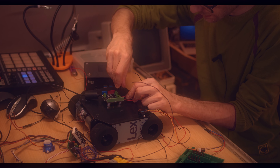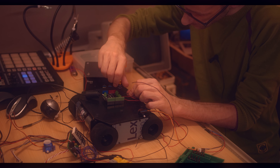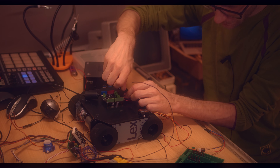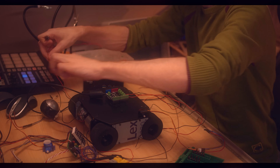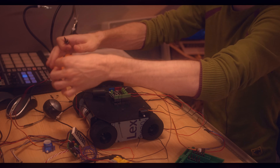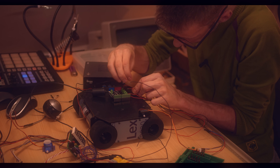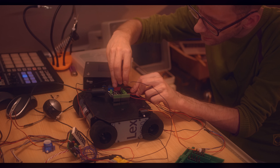Let's just turn this over real quick. This will be chaotic because I don't know how to structure things. Here we just have four B3 motors, 12 volts each. Each one of them has a positive and a negative wire. Very simply, you just solder them on — keep it somewhat sane, but in the end you do whatever you want. Basically the way this starts, I think the best thing to do is just hook up the motor controller first. Take your motor controller — this is a DF Robot quad motor driver shield for Arduino.